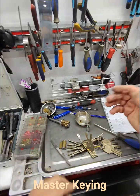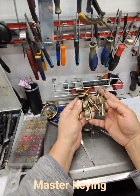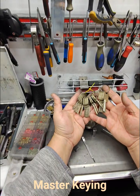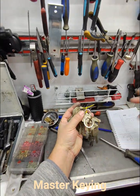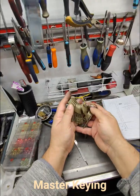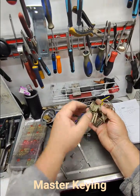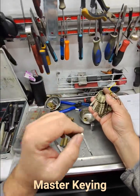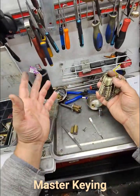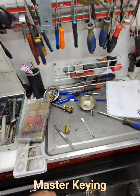So basically I could make one key work, ten keys work, five keys work — whichever way I want to do it. I just basically need to work out all the combinations, write down the codes, write down the sequence, rebuild the locks using the numbers. They're all precisely done to the exact specification, and if we do that we can make them work or not work. And that is my quick introductory video into master keying. Thanks for watching.